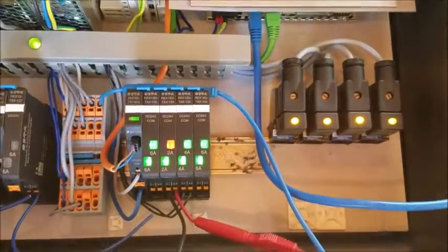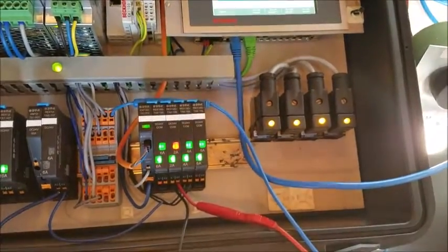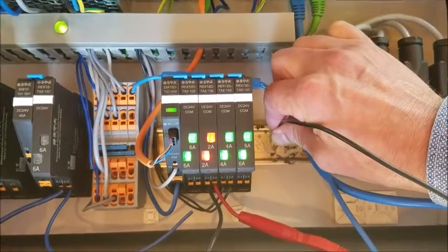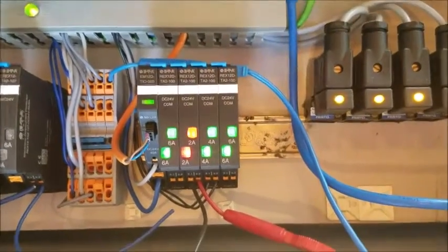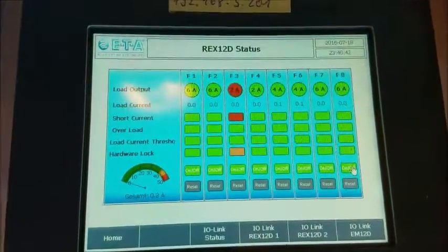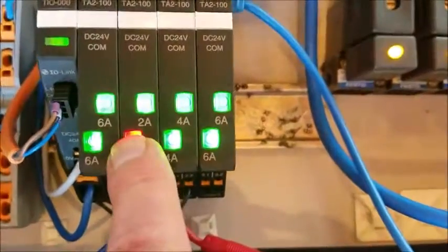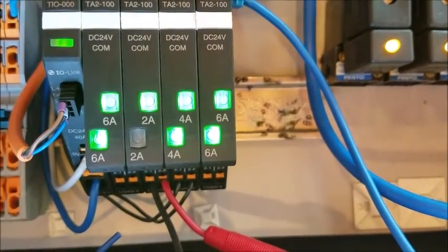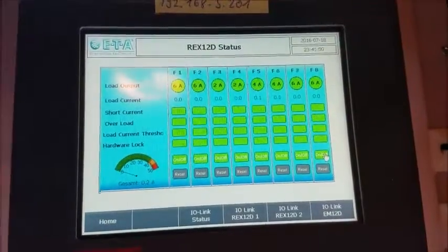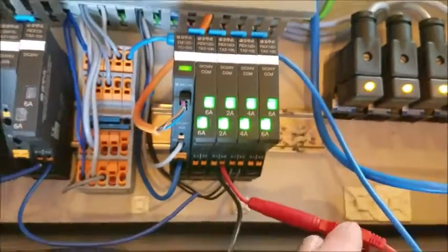We can show a short circuit back on the DIN rail — channel number 4. We tripped. The reason why after a short circuit the first press of the button is neutral and then it's on again is a simulation of a mid-trip position: when the breaker trips, you have to switch to off position and then on again.